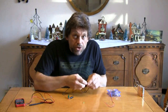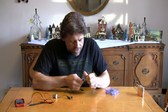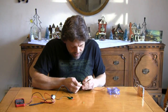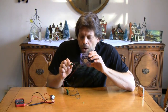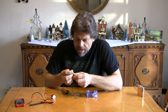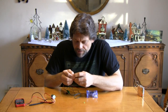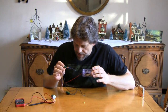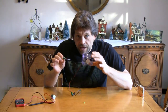This time I'm going to use the computer fan to do the same thing, only I'm going to blow on it. So what we're going to be basically making here is a wind generator. Let me check if I've got the polarity right. It's going to take a lot of effort blowing on this, but here we go — keep your eye on the LED. I didn't see it light up, so I think the polarity is backwards. Let me switch it around. If it doesn't light up for you, switch the polarity of your leads — move them to the opposite wires on the LED, or switch the leads on the fan. There's no battery involved here — just the fan and the LED.